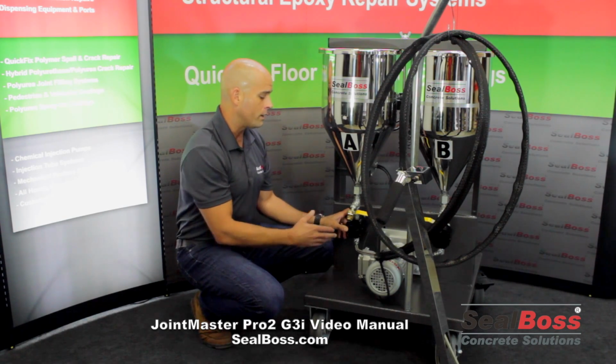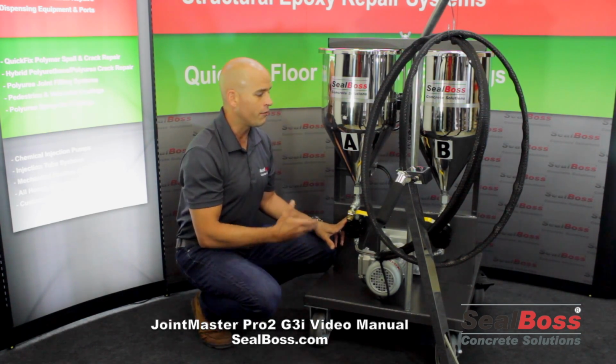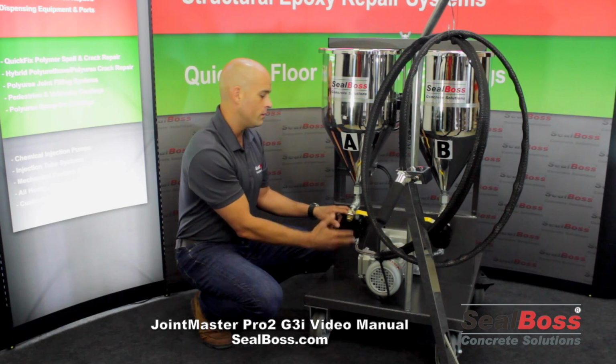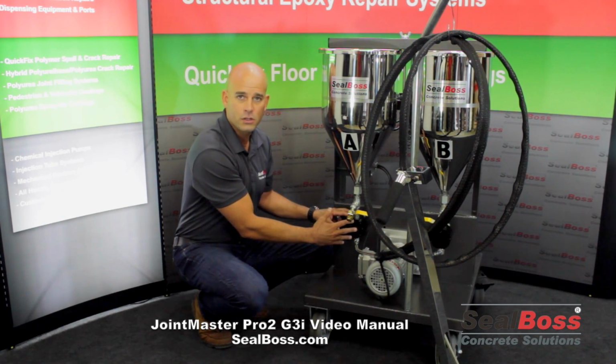in the event you do wind up with a condition where maybe you have a static mixer with cured material in it, and for some accidental reason the operator has left the machine in the running mode, you can wait a little longer than in previous times, because now, like I said, the ratings on these pressure seals is about 2,000 psi.